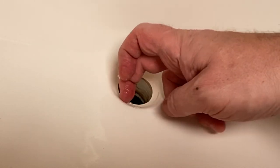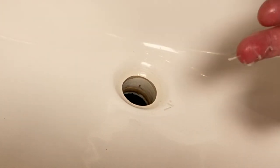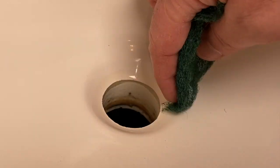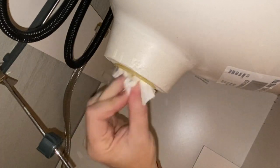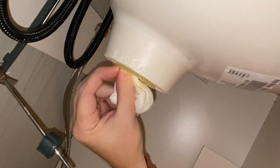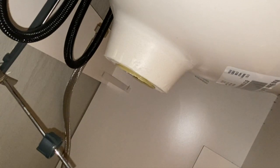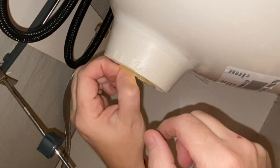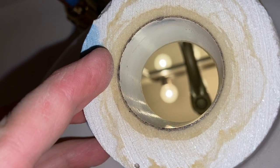You've got a little bit of residual right there, but it's not bad — we'll just clean that off. We're going to put a new one right on after we wipe that out and get it dry. Just clean the water off there. If you need to scrub anything off, grab one of these green scrubbies and just go around that. For down in the sink hole, grab a little paper and wipe out the inside. You want to get all that cleaned out and get the silicone off. You can scrape it off by hand — it comes off fairly easy. Most of it comes right off in bigger chunks. Or just grab a putty knife and make a quick job of it. You can see there's actually no silicone around this anymore — taken it all off from both the top and the bottom.